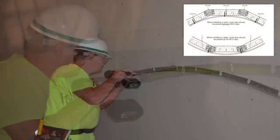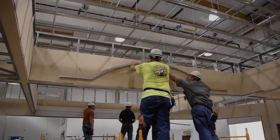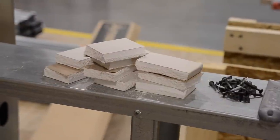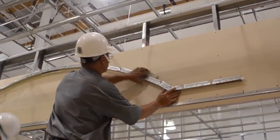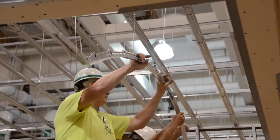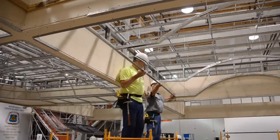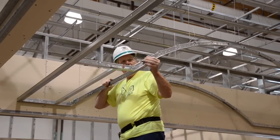RC2 clips make holding concave or convex shapes very easy. Instead of forming and bending cam angle at the wall, just screw a shaped drywall grid main runner to the wall, then stab your perimeter cross tees in. A 5/8-inch drywall spacer tucked behind the main runner keeps it upright while screw-attaching to the wall.